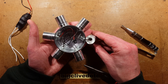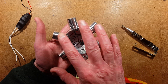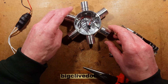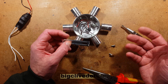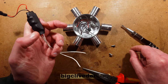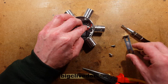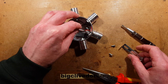This is just so customizable. If you wanted to convert this to a 12-volt fixture, you'd wire them as two series pairs of three LEDs with a resistor in series of each - if you've got a 12-volt supply, maybe solar-powered. The idea is you screw this onto the wall with wires coming through a hole, with either a terminal inside or a terminal in here. But by the time you get the driver in and the wiring, it's pretty tight to then fumble it onto the wall and get the screws in without snagging anything, especially when it's not earthed.